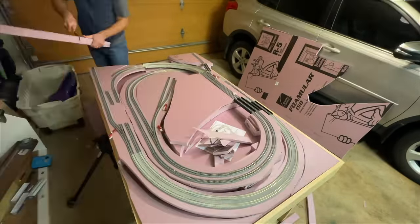Once things have cooled a bit, I come back with the liquid electrical tape. Often I'll use heat shrink tubing as well, since that is probably more robust overall, but in places where there isn't much risk for wires shorting out or where the tubing is hard to use, I just use the liquid electrical tape. It can be messy, however, so you might want to wear gloves when using it.